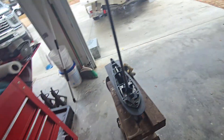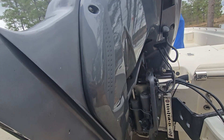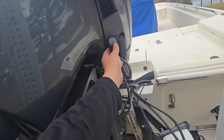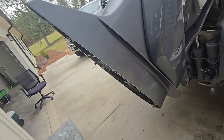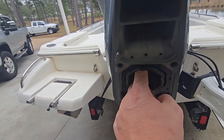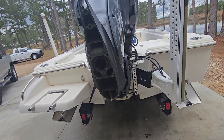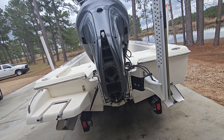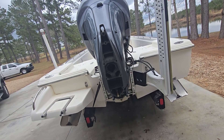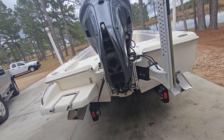You can also do a water test, which is pretty common. There are two ways to do it: you can hook a hose to the water pickup or water tube, or you can plug that and put a water hose on your flush port and fill the motor up with water. If water starts running out of this section here, you've probably got some excessive corrosion because water is getting into the exhaust — and that's a bad sign, definitely time for an exhaust replacement.